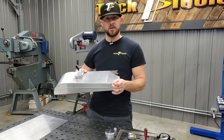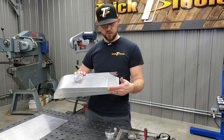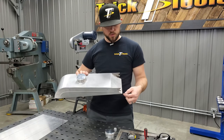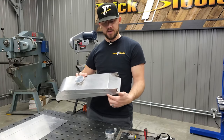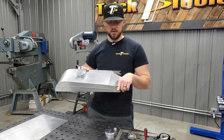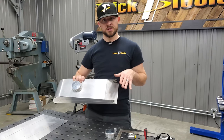But it's still just the thin aluminum that the material for the tank is, so over the years it's worn out. So instead of including it in the side, we're going to make the tank shape, get that all welded with a nice corner weld, and then we're going to make a new bracket out of 1/8-inch plate aluminum, and then weld that on the outside to give us a thicker, stronger piece that won't wear out as quickly on that bar in the front. So still going to be going with the same style of mount, but just done differently.